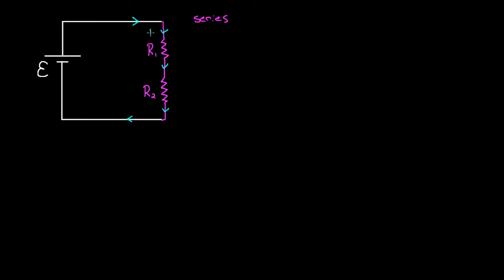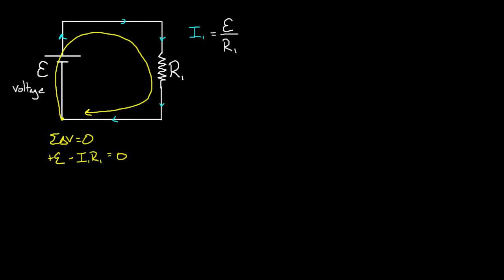So if all the current through one of these resistors equals all the current through the other, you know they're in series. That's important because when you have a complicated diagram, you might wonder if these two are in series, but you can just check. If one resistor is right after the other, the current that flows through the 100 all goes through the 50. There was nowhere else for it to go, so the 100 and the 50 are in series.